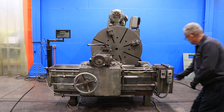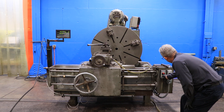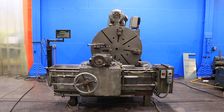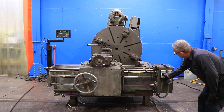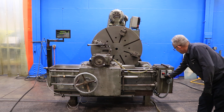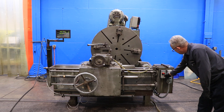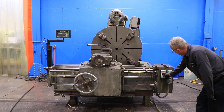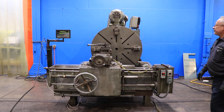We're in the low range right now. The machine has variable speed within two ranges. It's got an AC inverter drive — you can see he's speeding it up. It also has reverse; he's in reverse now.